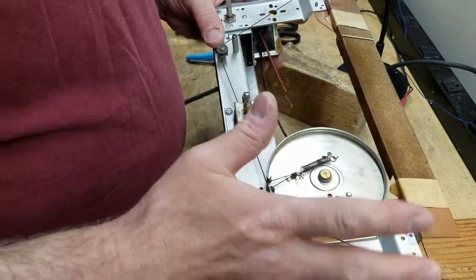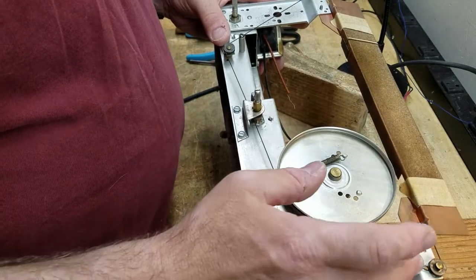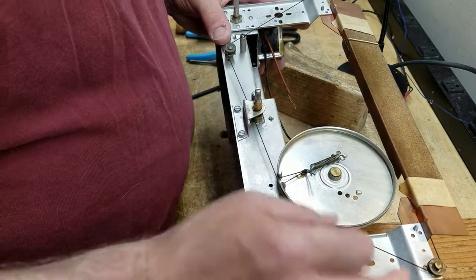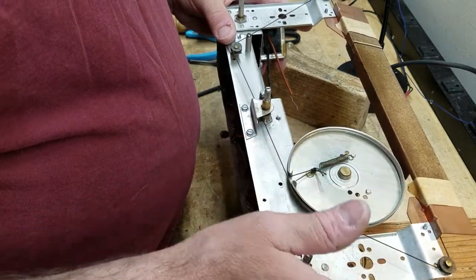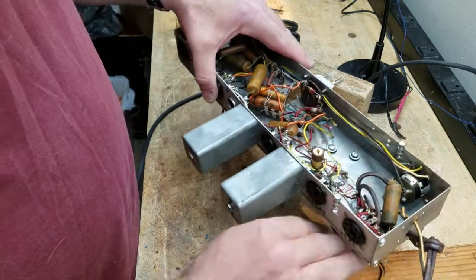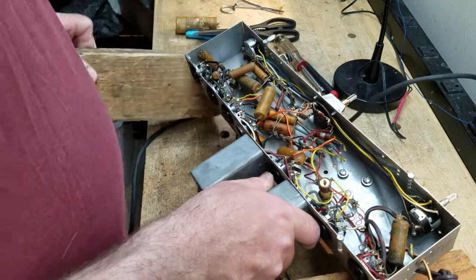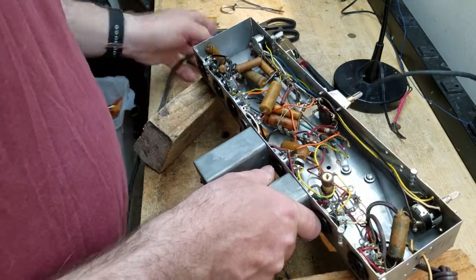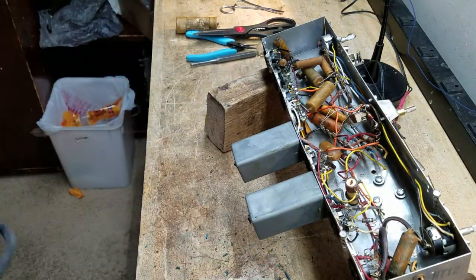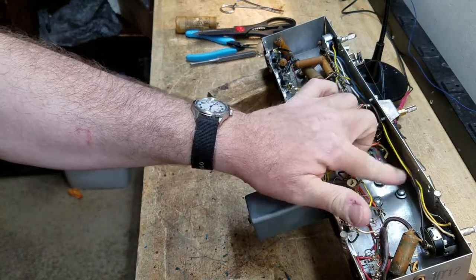So that's great because that saves me time, it saves me energy, it saves the customer money, and it saves originality. In every way it's good. If this cord were bad in any way at all, I'd replace it — it's not brittle, it's got plenty of flex, the spring is strong and good. So let's get back to the underside of the chassis. That means I'm not going to have to do anything with these three screws or the ground strap from this tuning condenser. Basically I can leave this tuning condenser just well enough alone. So let's get some terminal strips mounted in here and we'll go from there.